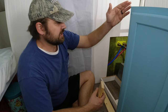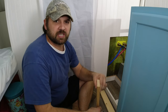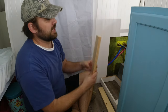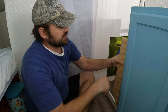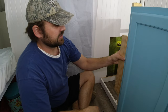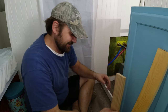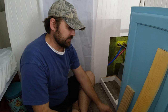So really we're just going to be building a frame, kind of like a picture frame, along the front — like when I built the bunk beds, if you can see that video. I'm going to build a rectangle out of some 1x3s and use pocket hole screws to connect it. It's going to be a frame that I slide in here, then we're going to build another part to stiffen it up. We're going to attach it to the side of the cabinet, the front face and this side face. Let's do that and then we'll start building this thing.